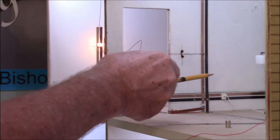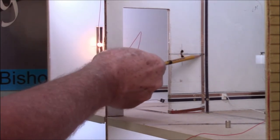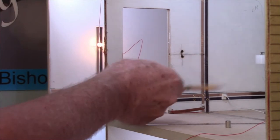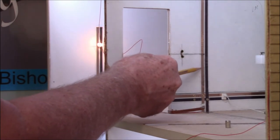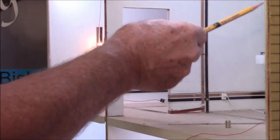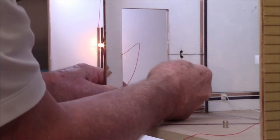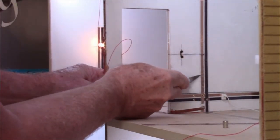Now I'm going to wire our switch to be positive. It's going to go this direction, is why we drilled the hole all the way, and we'll come out here and I'll solder it to the red wire on here. I also need to cut the wire, or this tape wire, someplace along here, so that when the switch is on, it's causing the electricity to go up and turn on just this light that's over there. So let's take our razor blade, and I'm just going to go ahead and just cut this right there. And we'll come up to center and then peel across.